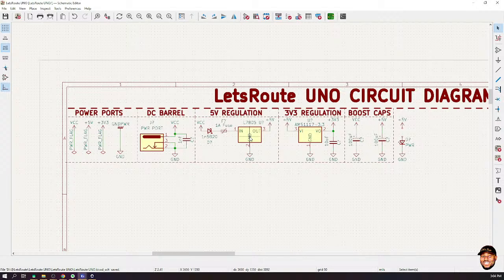That's number one. I could raise this polyfuse to, let's say, 1.5 amps, because of course this LM7805 can allow a maximum of 1.5 amps. I could do that. But the whole thing is about intended purpose. What we are doing, we don't need that much current. So as a designer, I have to restrict it. If somebody else is doing this, and probably they are using a 5-volt regulator that could drive 3 amps, and you see a 3 amp over there, it's because of their purpose. It's not because, generally speaking, anytime you are doing this, you should use a 3 amp regulator. So understand these things. Your circuit is up to you to design. You design according to your needs, not according to what somebody else is saying.